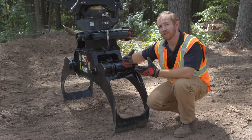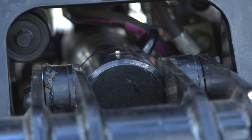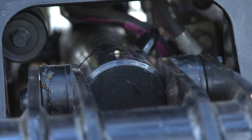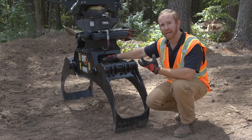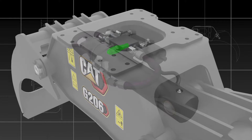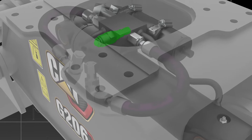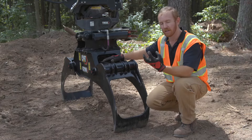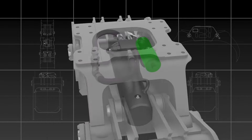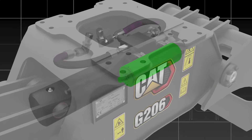The first area I want to look at on this G206 grapple is the hydraulic setup. We've got a single hydraulic cylinder that's center-mounted in the grapple. With this hydraulic cylinder, we've also got a locking valve and an accumulator. The cylinder gives us that high grip strength we talked about. The locking valve prevents the grapple from losing that grip over time — maybe you're traveling with your material gripped or swinging it around to load it on a truck. The accumulator stores a charge of oil so that in the event the load slips, the grapple can cinch up to maintain the grip.